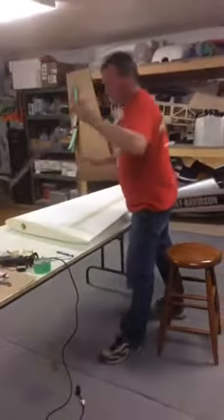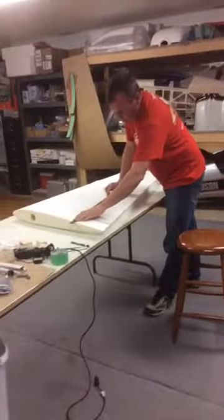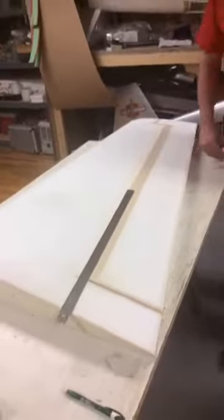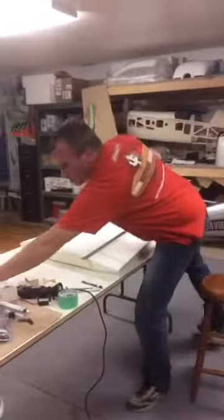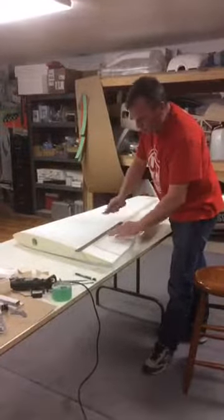But you can see, you're going to lay a straight edge on there from mark to mark, and you're going to go perfectly down the center of that 3/4 inch block. And then when you bevel it, it just comes out absolutely beautiful, beautifully strong. So again, every single step, you're going to take blue tape and run it on so that you can use a super sharp chisel to clean it down to the blue tape.